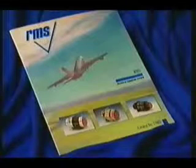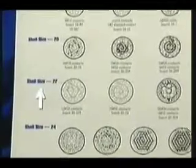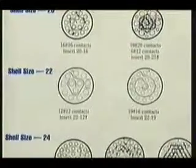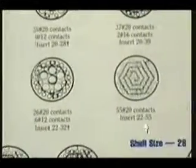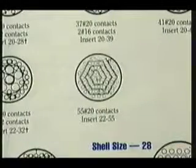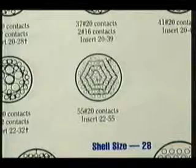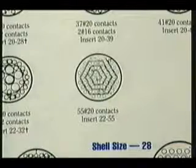The code is your guide for selecting the proper insertion and removal tools. R0716 is the connector reference used in the RMS Catalog. On the available inserts page of the Catalog, you can find shell size 22. Note that there are four inserts, each with a different contact reference number: 12, 19, 32, and 55. You're looking for 55 to correspond with the 55 on the package insert. Next to the 55 is another number, 20, that tells you what type of tool to use for insertion or removal.